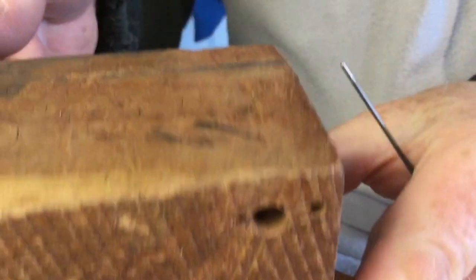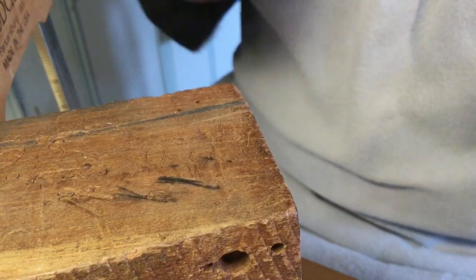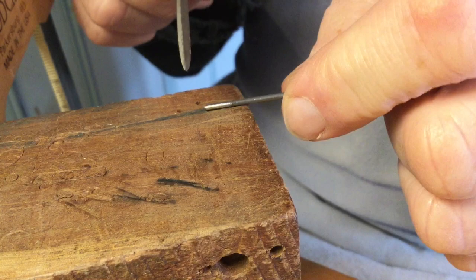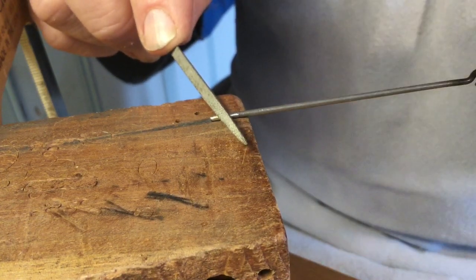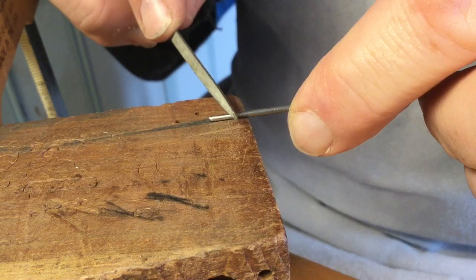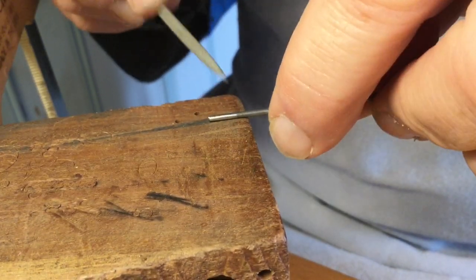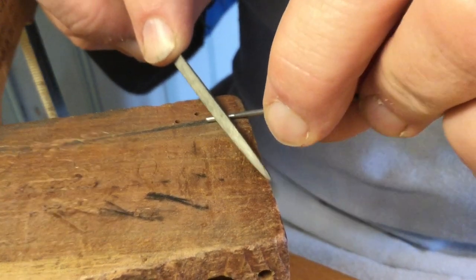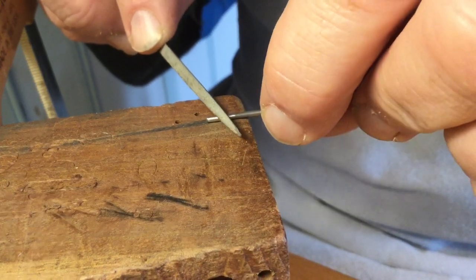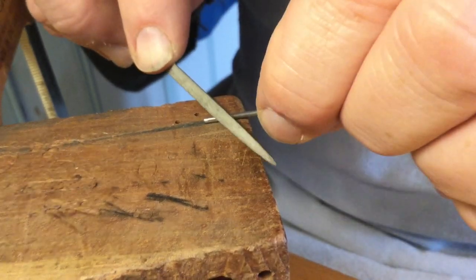This is a chunk of red gum with a couple of little grooves filed in one end, and you can put a clamp on it to make it stable. I'm rolling the wire in my fingers as I file, and not pressing hard. I've hit this with a blowtorch to anneal it — you don't want to try filing music wire straight from the shop, as you're liable to damage your file. It's very impressive stuff.